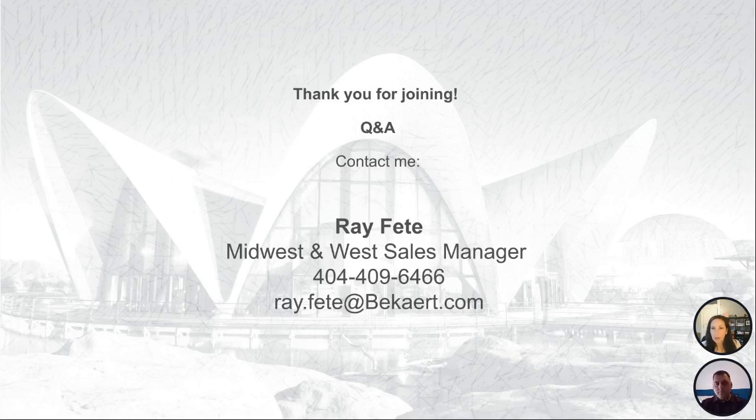All right, great questions. David asks, what would be the difference in load capacity between a 3D and a 4D fiber? Well, numerically it's tough to call, but 4D are usually higher. So you can sometimes design a floor with 3D fibers or 4D fibers, but generally it's more cost effective to go to 4D because the overall dosage is going to be lower than that of a 3D fiber.